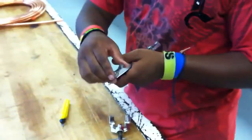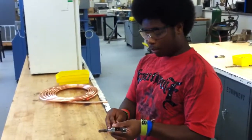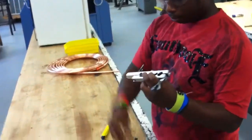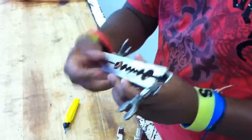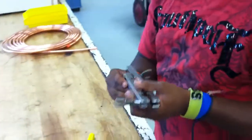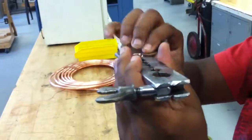Alright, next what you're going to want to do, you're going to want to move this copper tubing about a penny high on the bevel side. It's a bit too high. I'm going to drop the pin — right there. See that? Penny high.